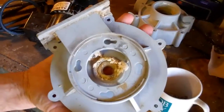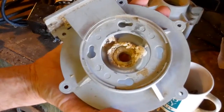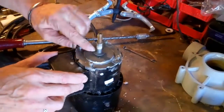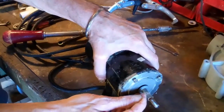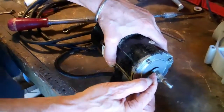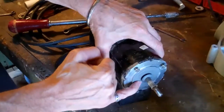There's your corrosion from the leaking seal. That's a slinger. This is called a slinger and it's designed to stop water. When the seal fails, water is going to, by capillary action, travel down the shaft. The idea is when it hits the slinger the centripetal force of the turning motor will sling the water off.